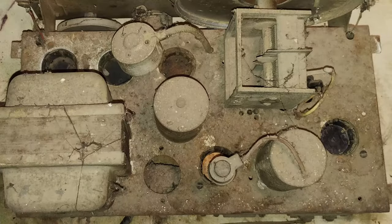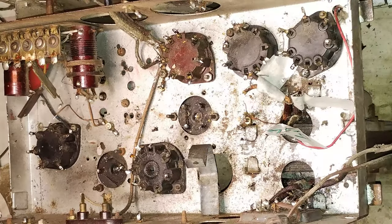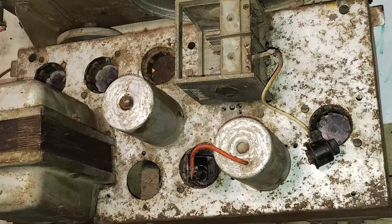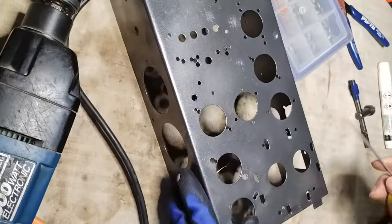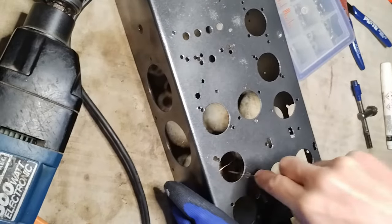This chassis was not made for European side contact tubes, also known as transcontinental. The sockets for this type of tube require larger holes, and should be installed from above the chassis. In this radio, instead, the tube sockets were installed from under the chassis, with only some minor adaptation. Considering the precarious condition of the original tube sockets, it was planned to replace all of them with new ones, also trying to install them from under the chassis. Nevertheless, that required some more minor adaptation to the chassis.